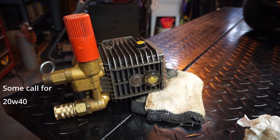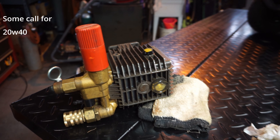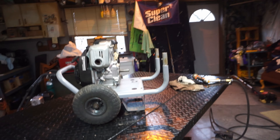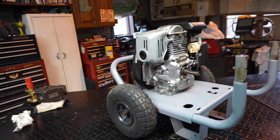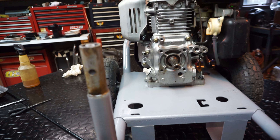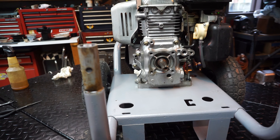If your pump oil is getting old, just change it and get the correct oil. They have it on Amazon — just look up pump oil. It's a little bit thicker. You don't want any detergents in it; you just want a good oil developed for a pump.